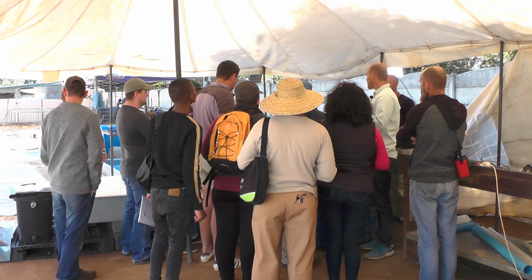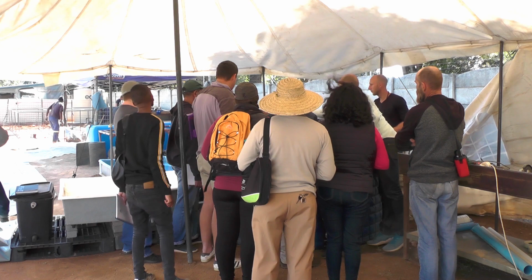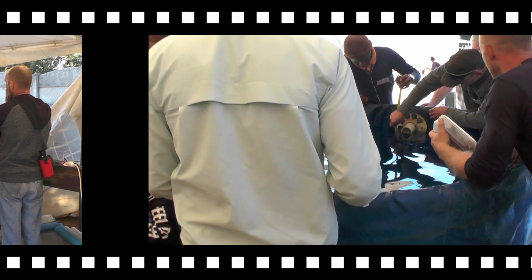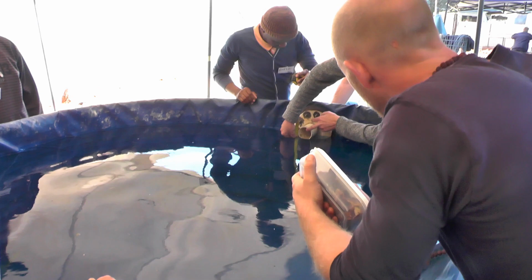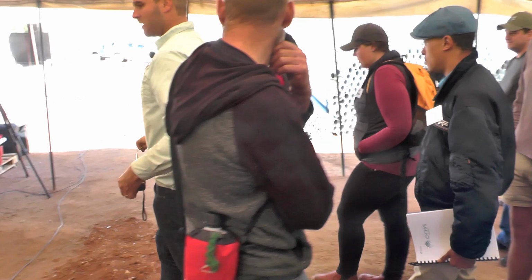What's important is to actually measure the height of the outlet, so we have an understanding of how high the outlet is. If you just measure the height of the outlet of that pipe from the bottom of the tank inside to the height of the bottom of that outlet. If you straighten it, it's about 900. Okay, cool. So then let's go back to our workstations. We've taken our two main measurements on our tank, and let's now go calculate how we're going to actually build the solid lift outlet.